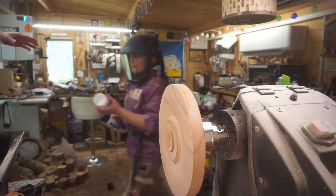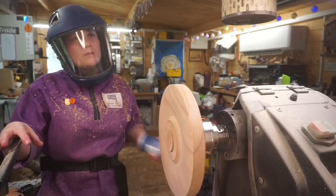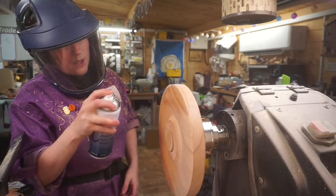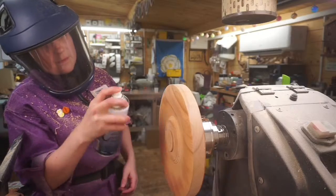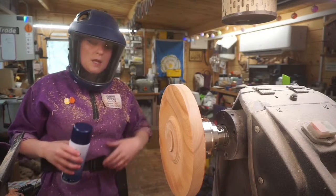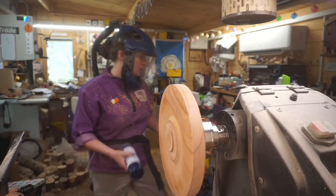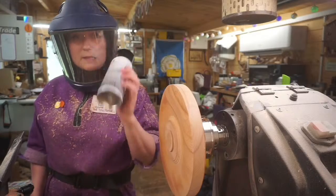I'm going to try a different lacquer today, and a different ebonising lacquer, because there is a reason why. I'm currently trying out various different ebonising lacquers, because sometimes if you do too good a job at applying them, you end up with a bit of a shiny surface, and it can repel the two products that we put on next, which causes problems. So my usual go-to has always been Chestnut Ebonising Lacquer, and this one is Satin Lacquer.